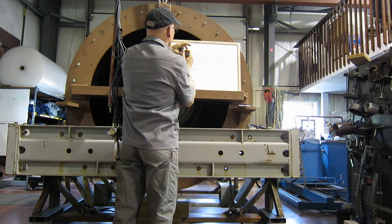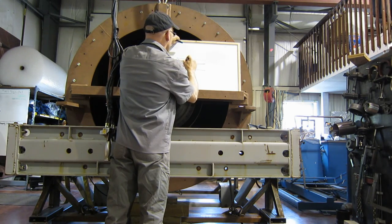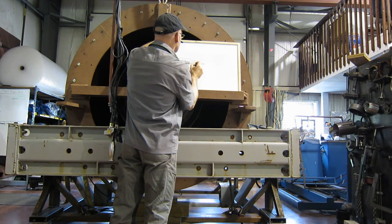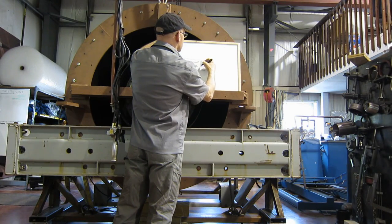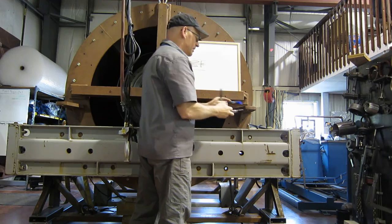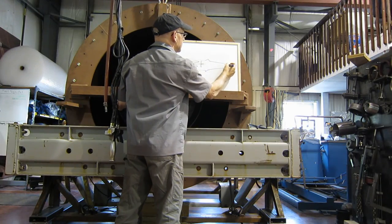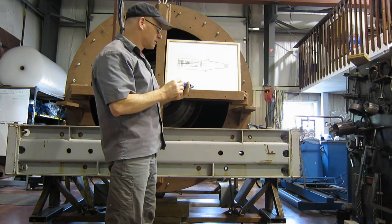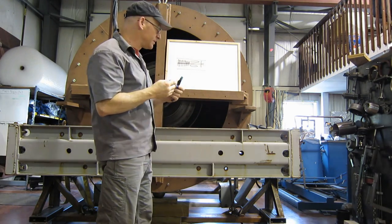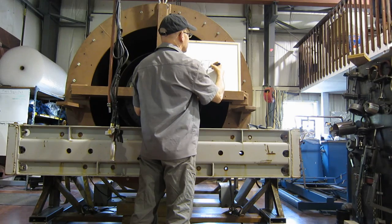There are the cases, and let's get a different picture for the shafts. We've got a compressor — 16, 17 stages. We've got the combustors. And then we have what's known as the gas generator turbine. That's the engine you saw in the test cell. In the test cell it had our fancy looking jet pipe producing exhaust gases. Now the engine, as you see it right here as we just walked around, has what's known as a power turbine. And this power turbine in this engine has six stages.